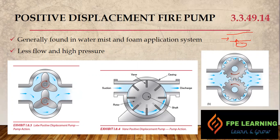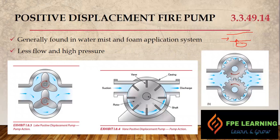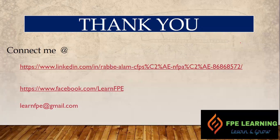In a water mist system, very high pressure produces small, tiny droplets of water that are sufficient to exclude oxygen and cool the surface to fight fire. This type of arrangement is also used by civil defense teams on fire trucks, where they need high pressure at elevation. So that covers all the fire pump types — centrifugal pump types as per NFPA 20, and positive displacement pumps as per NFPA 20.